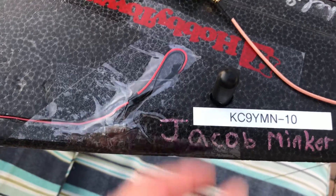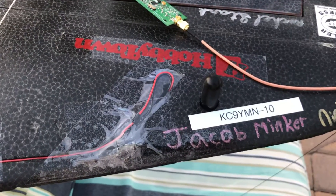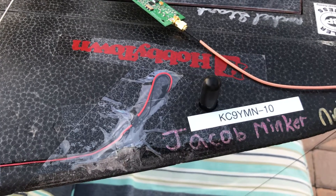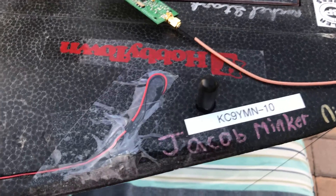These little antennas you can buy from Bionics — these are called the v10. This antenna is not really a long-range antenna; it has about zero gain. It's really just good for our purposes of flying around at the local field and just integrating everything. The way we did this — show you up underneath here — there is the APRS unit mounted with a 90-degree SMA, just taped on there to protect it, and it's recessed into the foam slightly.